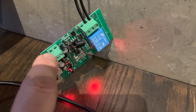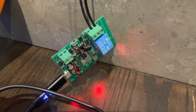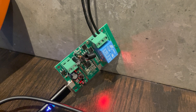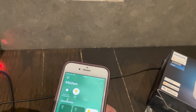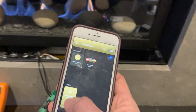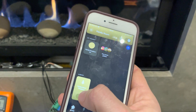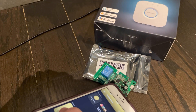It doesn't actually matter which order those are connected into the fireplace. I'm not supplying this with a DC or AC dedicated feed — I'm just using USB low voltage. USB can be fished through the walls without electrical code concerns, but you would need to follow code on how that power supply is delivered to the relay. So I have a Hue bridge and the Hue app, and from the Hue app I have my fireplace control. Really all we're doing is closing and opening a circuit on the fireplace switch control module using a Philips Hue bridge to a Zigbee smart relay.